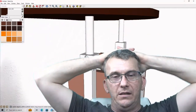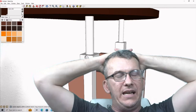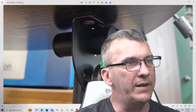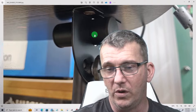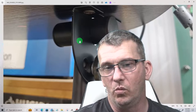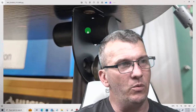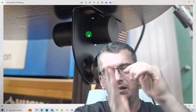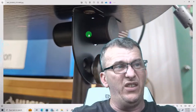Maple dowel, it would be 7/8 of an inch in diameter. And the top, so what my thought process is, this top right here, I'm going to make this bracket and everything, or I'm going to use one of the two. But this circular dowel here is 1 inch. If I have a 7/8 inch dowel here, a 1 inch dowel there, then I can create a jig, kind of a V-shaped jig on my CNC, and I can mill a 7/8 inch pocket hole for that thing to fit on, and then I can glue those two parts together to create this assembly.